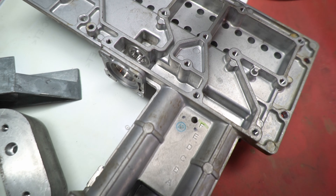Die cast is an alloy of zinc with aluminum, sometimes called Zamak, which is a trademark mix of zinc, aluminum, magnesium, and copper. It's used instead of aluminum because it's more durable, so it can be thinner and flows into more detailed castings better for decorative or complex shapes.